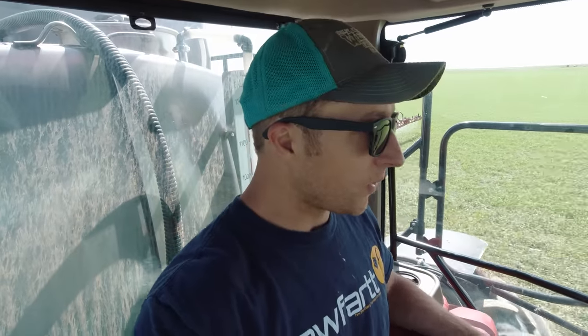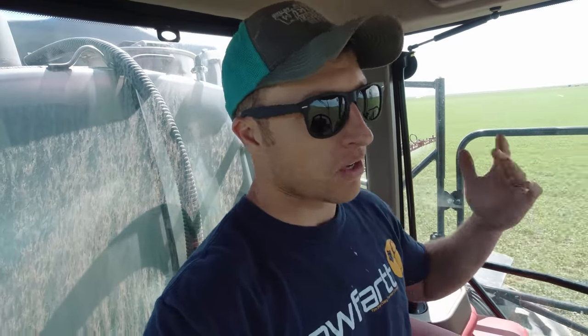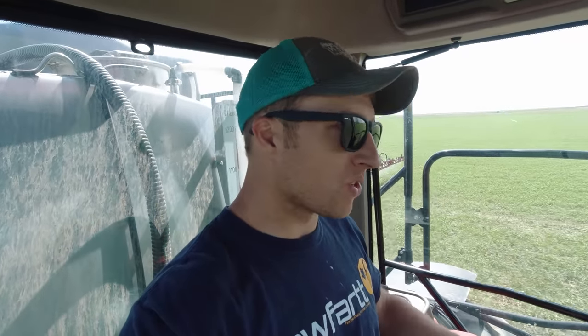Two, the sprayer's up tall so you can clear crops like tall corn, or if you're dressing or doing a fungicide application or whatever, your sprayer's gonna clear the crop. So only your tires are gonna drive over it, and that's it. That's one thing nice about having a hydrostatic drive. That's hard to do with the gear boxes, because then you gotta have drop boxes, you gotta have drive lines with universal joints. There's all kinds of different ways to get the power to the wheels. Hydraulic, hydrostatic, all you gotta do is have hoses. That's simple.